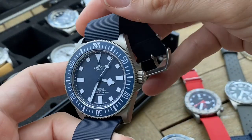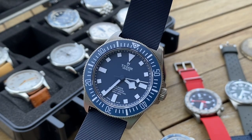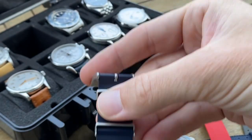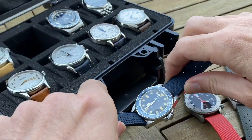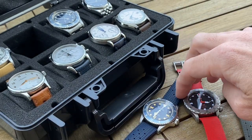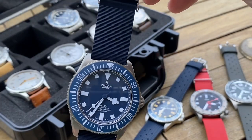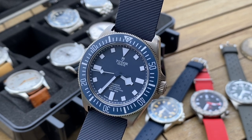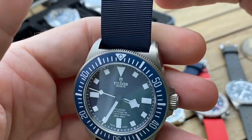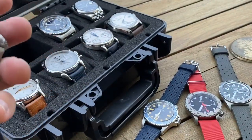And when you look a little bit at this, and when you ask people who actually know about metal, they say, yes, theoretically grade 2 is more corrosion resistant, but not in any environment where a human would survive. If you were in a chemical processing plant, by all means, use grade 2 as a pipe. It's going to be better than grade 5. Typical hangout on the weekend. Exactly. Or if you are in a desalination plant, where the level of salt is sky high and the flow speed is super high as well, yes, grade 2 would be the better application. But just to go in the swimming pool or in the seawater, it makes no practical difference.